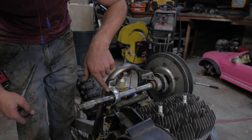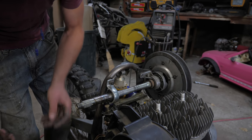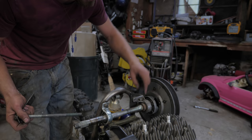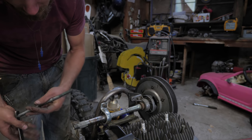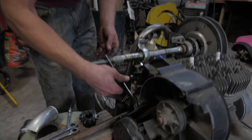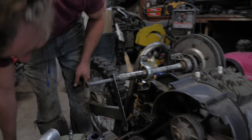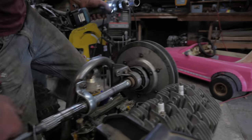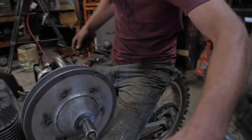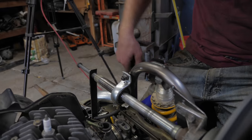And then I had to grind it down to fit the inside of this carrier bearing. So I made myself another North Idaho lathe, which obviously this bearing wasn't here and it was just the one, so that's not enough. So I took this bolt, stuck it inside there, bolted this little bracket to there to make a very rudimentary bearing. And then I sat here on this tire with the drill, and then used the grinder on it to grind it down.